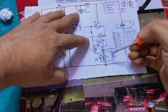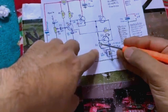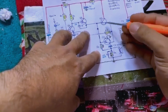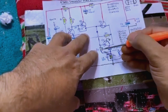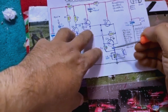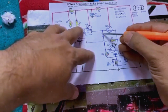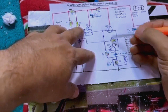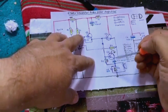That's very strange. We don't know exactly what happened here — is this a bootstrap? Is it bootstrapping the biasing for the two transistors, or is this transistor using the capacitor connected to resistor R8? I'm not sure actually. What I can say is that you can see it is using a diode to prevent what is called thermal runaway or heating of the two transistors. That is good, but we actually used two diodes.